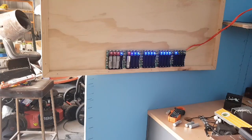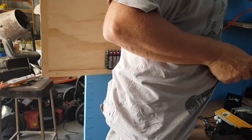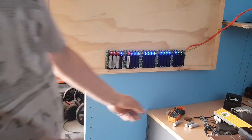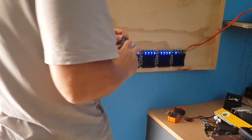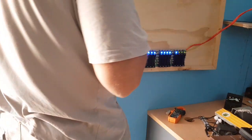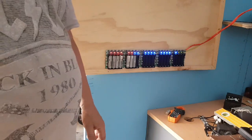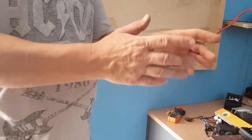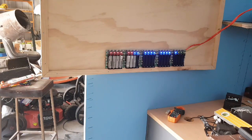Hey guys, I've hooked up heavier wire than I thought. I've removed the other power supply and put the server power supply in. I've got to use some Kapton tape to cover the power supply to stop it from getting shorted out, but I think I've fixed my problem and now it works properly. I had a really bad problem — I talked to Brett in New Zealand — I had two of these power supplies one after the other that were absolutely stuffed. I did pick them up second-hand, but you've got to be careful because you might read the right voltages off it but the actual device isn't putting out that type of power.